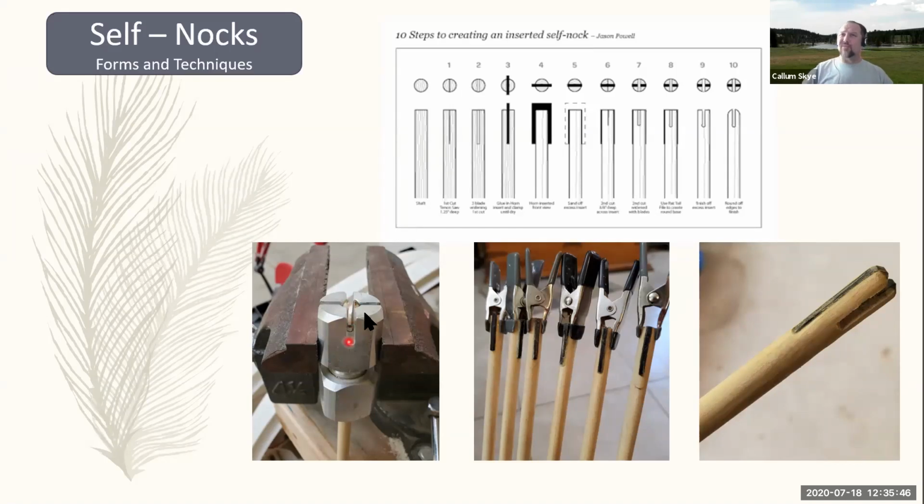It has 2 different directions, as you can see demonstrated here in this example. There's one cut that you're going to make, which is going to be long, and that's for the horn insert. So let's say that's on this side over here, going in this direction. You'll cut that down and drop that horn insert in. Then you just glue it in. Horn glues to wood very, very well. Most wood glues are all you're going to need to affix that down there.